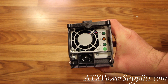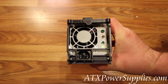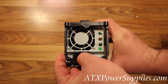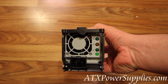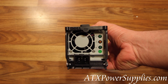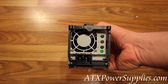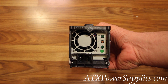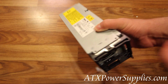There are three indicator lights on the power supply face. The one on the bottom is green and will show whenever you have the power plug plugged in and there's electricity running to it. The one in the middle is an alarm and it will turn orange meaning the power supply has failed or there's some kind of problem with the circuitry. The top light is green and will be on whenever it's plugged in and everything is normal.